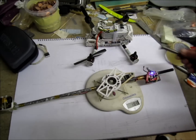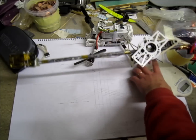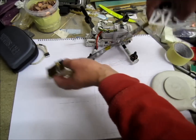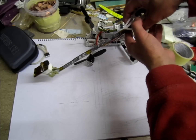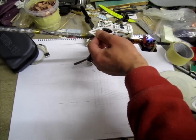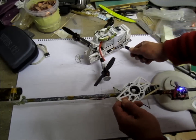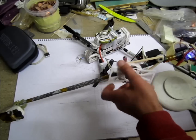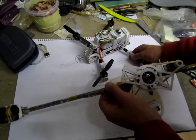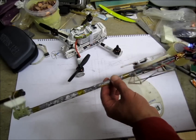190 grams — the same as with the bolt balanced at the end. It absolutely has to be balanced, otherwise it will be nearly unflyable. If the camera weight is at the front when flying forward, and then when you pitch up the camera will swing to the back, that will mess up the controls. I've been there, I tested it — it has to be balanced.